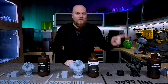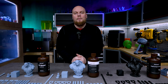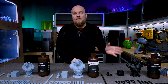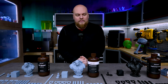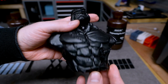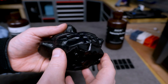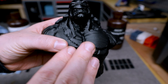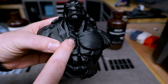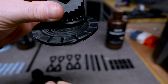The Engineering Pro is a very hard resin to print. I poured this liquid at about 50 degrees C and even at that temperature it was still very thick and goopy, with a few failures here and there. Looking at the print quality, we can see it started failing at the bottom, but the supports took over. This was printed with very light supports, so it would benefit from heavier ones. You will need at least two seconds of rest before exposure, bigger supports, and enough rest time — then you will be mostly fine.